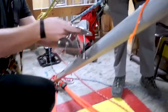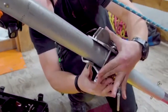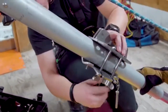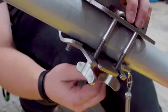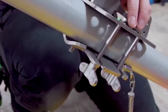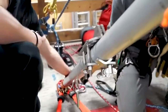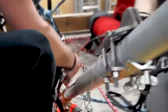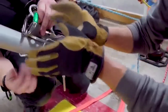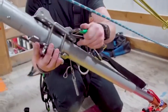The mounting plate is a clamping style compression plate. It'll fit anything up to a three inch diameter. Once the clamping mechanism is adjusted to the diameter that you'd like, everything is going to be just wing nut control to snug it in place. Now we're going to back-tie the plate to the foot of the tripod or to another stationary anchor to keep the plate from chattering up the tripod leg once there's a load on it.